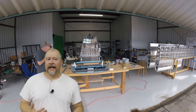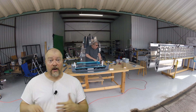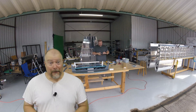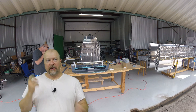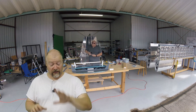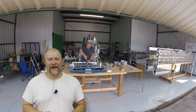The firewall is stainless steel, and first of all, it's sharp. I've cut myself, and all of my tools for deburring and removing sharp edges from aluminum do not work on stainless steel. A good idea might be to put some tape or get a file — something harder than stainless steel — and file off those sharp areas, which is what I did. I still managed to cut myself once. There will be blood on your plane. You're gonna bleed for your plane. It just happens.